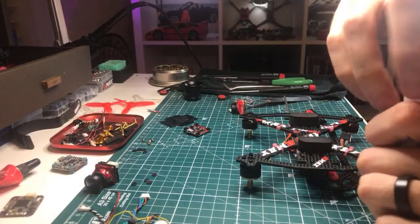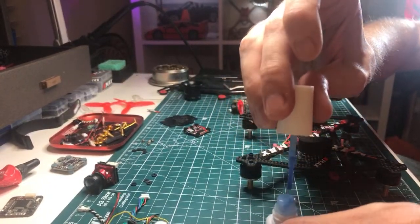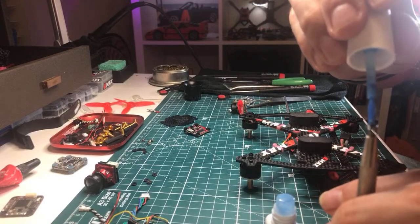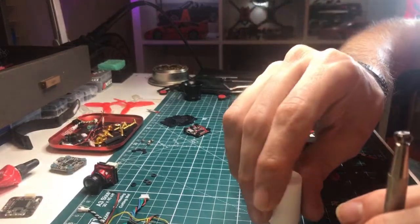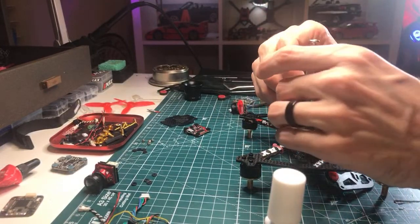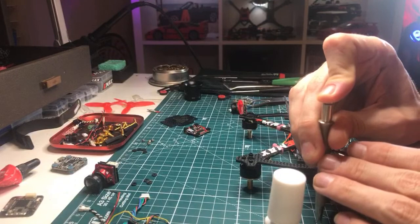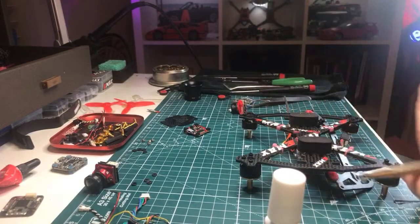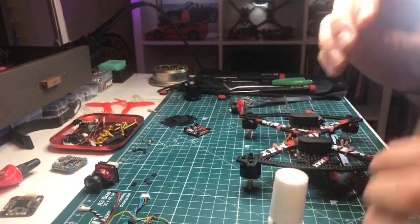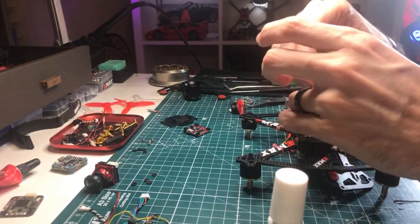Spudnik, yeah, man. Well, it depends. If you're serious, let's talk for absolutely sure. I won't tune it if it doesn't have motors that I know are tunable. That's why I'm not just going to give you an absolute yes. The Emax 1606s, for example, are just untunable. They're too notchy. They're a dedicated hardcore race motor, and they will not tune well on a freestyle rig, or at least not on the Acrobrat frame, because I haven't tried other frames.